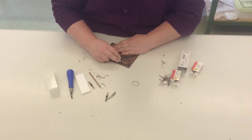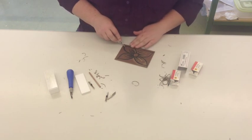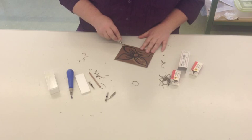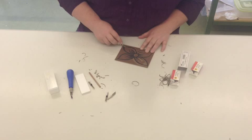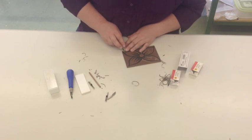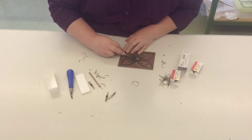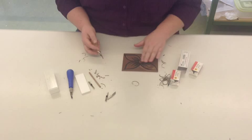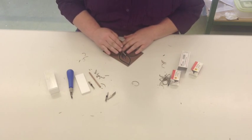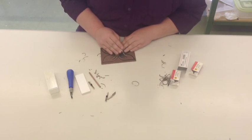I get almost to the corner, I stop, and I turn that blade around. You can see I'm moving my hand away, still holding it firm, and I cut out from the corner. I wiggled in just a little bit to get it — if it's only a little bit and you're not sure, you can wiggle your way up and then join the line. Now I'm going to cut out from the corner, go almost all the way into the corner but not quite, then stop and turn it around. Once you get into the habit, you can see how quickly you can do it.